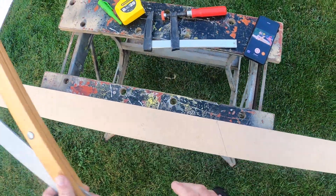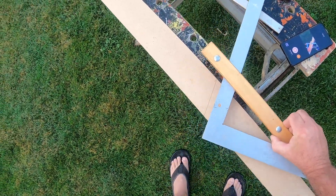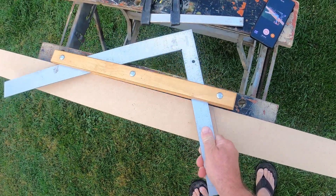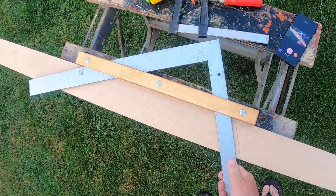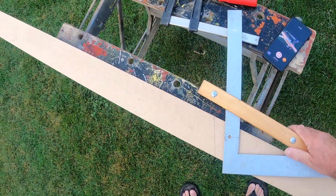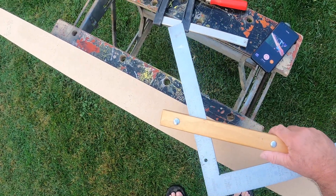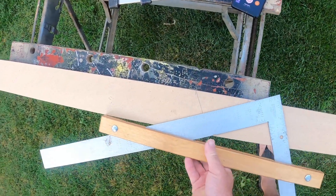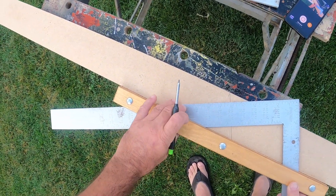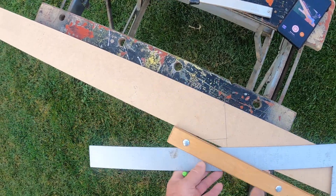With the gauge, you can mark your plumb lines any which way. Note that we move the framing square every which way we want and we will always get that same angle. Spin it 180 degrees — never turn it all the way around, especially when you are working without the gauge. I'm going to give myself two inches of bearing, like so.